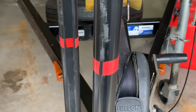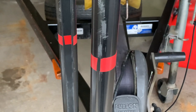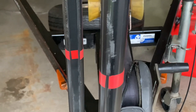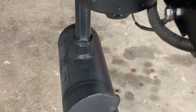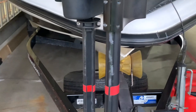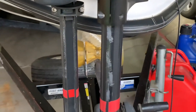There are also two red tape marks further down the shaft — when raising the trolling motor in shallower water, simply raise it up to the red tape marks on both sides to maintain an equal distance and the proper gap between the transducer and the top of the prop to avoid damage. Loosen the two allen keys to adjust the height as needed when fishing in shallower water.